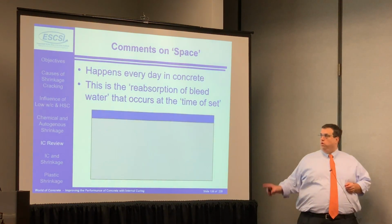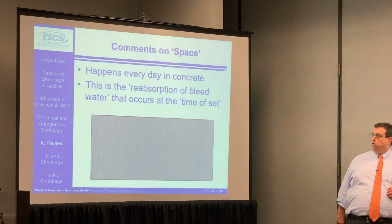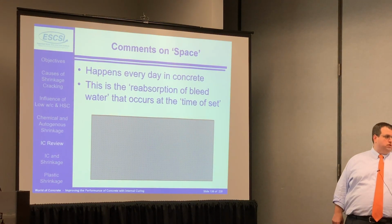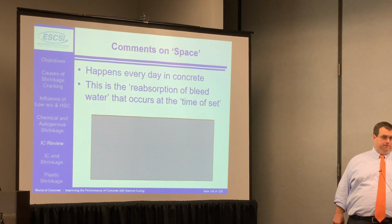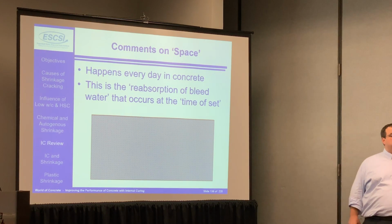Now, I mentioned this before, but this happens every single day, and people watch this every single day. So my father was a contractor. I learned very early that the time to finish the slab is right after that water sheen goes away. You've got time to smoke 1 cigarette and get out and start finishing the slab. The reason is this is when your concrete's starting to solidify. It's that solidification that creates that suction pressure. That suction pressure is that same stress I was talking about that's driving the shrinkage. So all of these things are related.